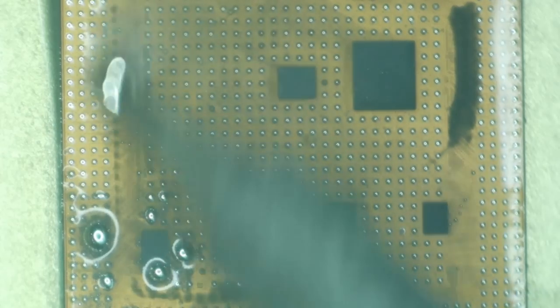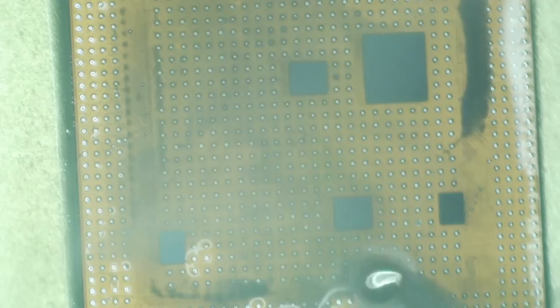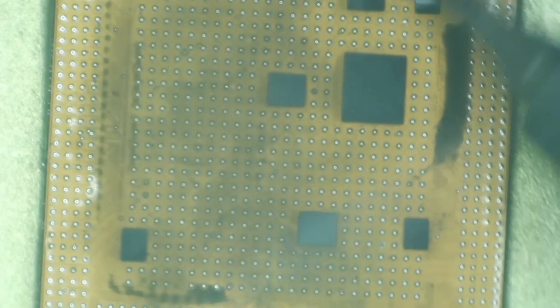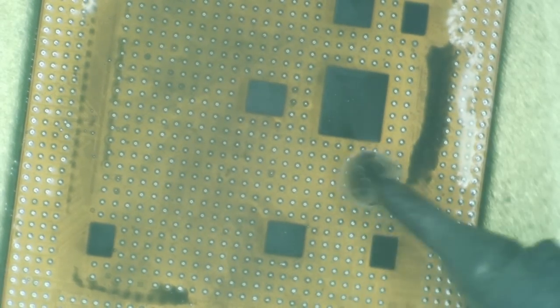And honestly, on one that doesn't have any glue hardly at all on it, it may not even be necessary to go all the way down to 138 degree alloy. On the sandwich boards, I normally put the CPUs back on using leaded. That is because the sandwich has to go back together using 138, or at least that's the way I put them back together.